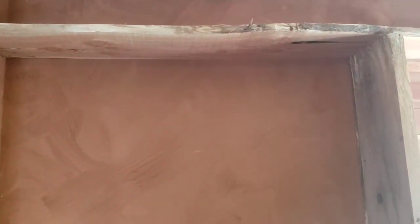These are my clay walls that we did almost a year ago. It's just red clay dug up out of the yard, mixed with playground sand and water. What I did was took a test board — I actually took some test drywall and painted it on there until I got a thickness and consistency that I really liked. What I'm gonna do today is seal them.